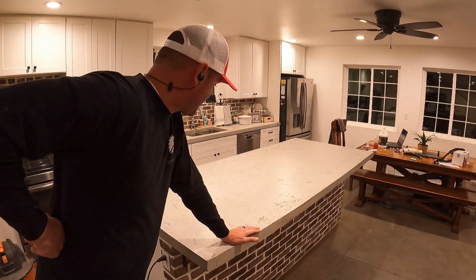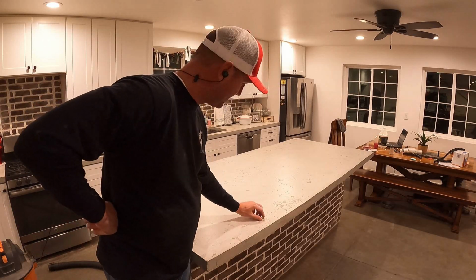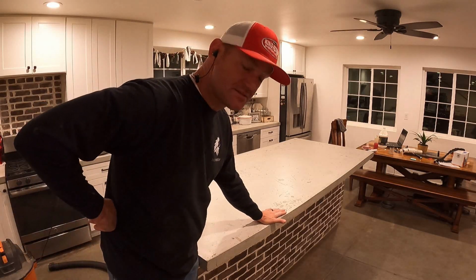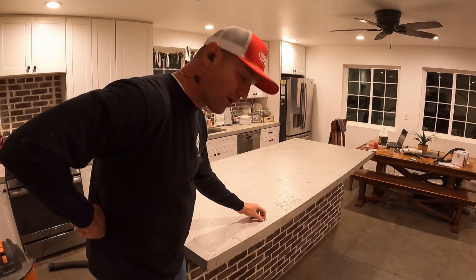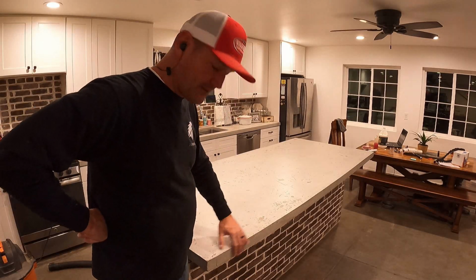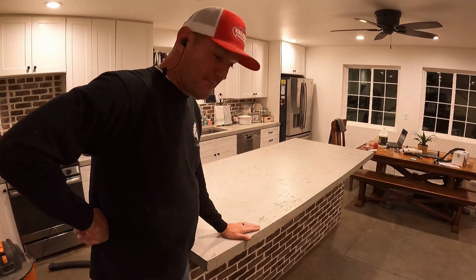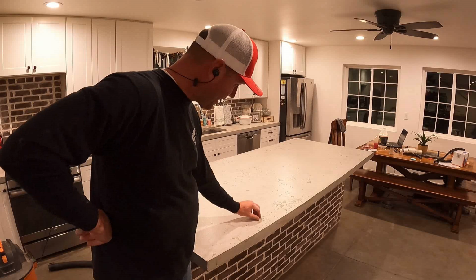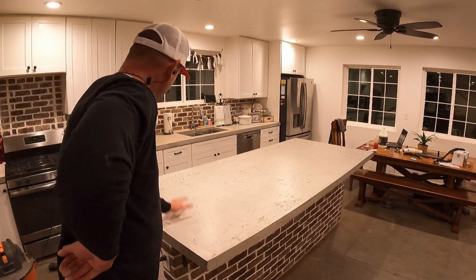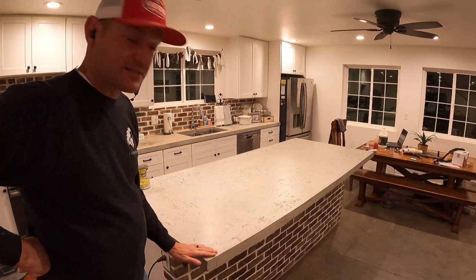The sander is just, it's 220 grit sandpaper, so it's kind of just polishing the epoxy. I think I'm gonna go out and get a razor blade. I gotta get the epoxy off before I can sand the concrete and really get this smooth. But the objective is to really try and polish this up a little bit. I may even try my heat gun, but I feel like over there where I sanded it, I ran my nail across it and the epoxy came up even easier. So I'm gonna go grab a razor blade and see if it makes a difference.